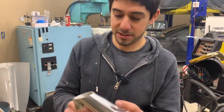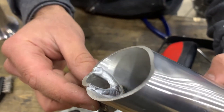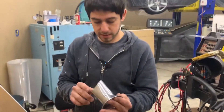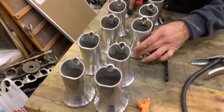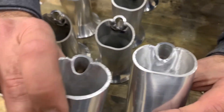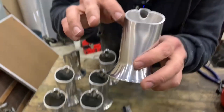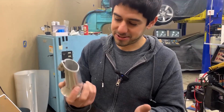We finished one here — we just welded around like we were saying before. So all ten are done. We're gonna go ahead and clean it up. You can see one is already cleaned up. We're gonna grind it down so it's smooth, not to impede airflow. With this done, we're gonna go ahead and start moving on to porting the plates to the heads.